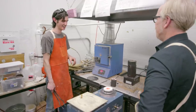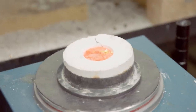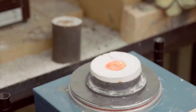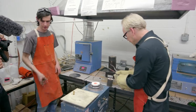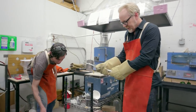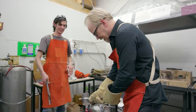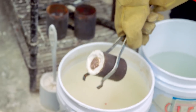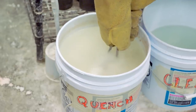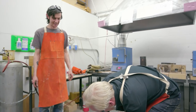Surprisingly, no serious incidents — touch wood. This one should be fine, you can see the metal's nice and solid up top. Grab a pair of tongs and put it in the water — we'll do this bucket right here. Go down and then get the whole thing under or it's going to start spitting everywhere, and it will shake pretty violently on you. And you'll just drop off a cliff, doesn't it? Quickest way to break out plaster.